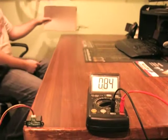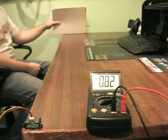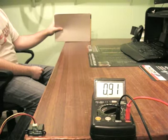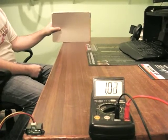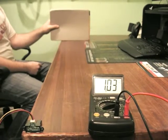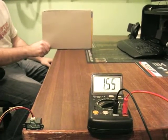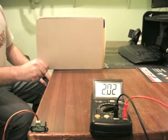There is no interaction with the HC-12 for this particular exercise. It's not required to have any additional inputs into the sensor itself — it just outputs a voltage relative to what it measures. Let's do some tests. Grab that book and start at the other end of the table so we can view the multimeter. It's currently sitting at 0.8283 volts. Moving it about 20 centimetres toward the sensor, we can see it's at 1.01 to 1.02 volts. Keep moving — that's about 50 centimetres from the edge of the table, about 80 centimetres to the sensor.